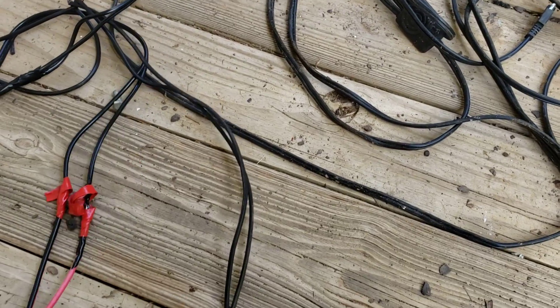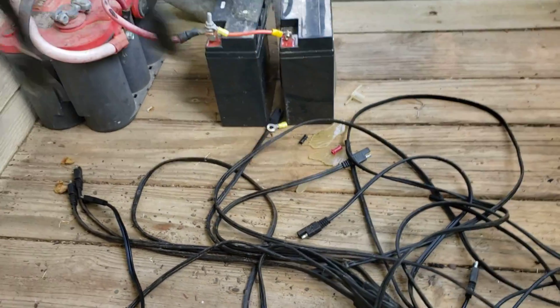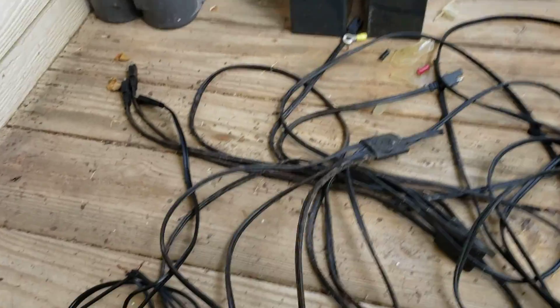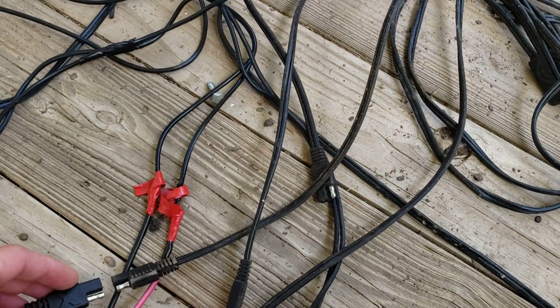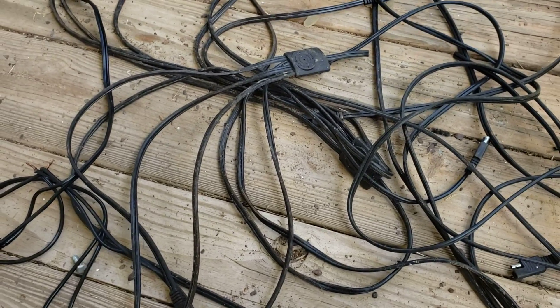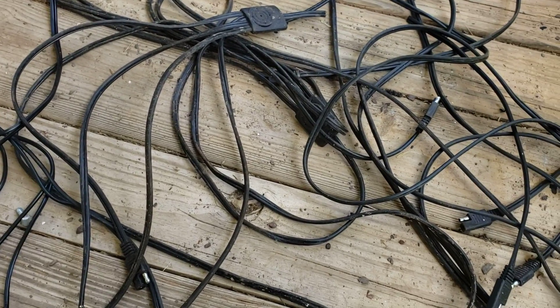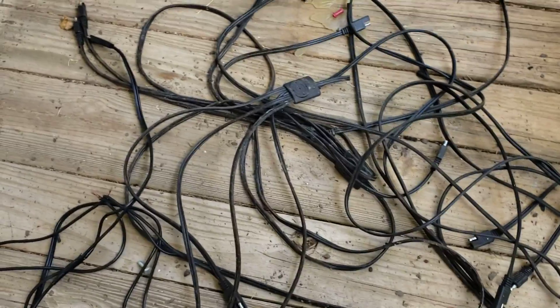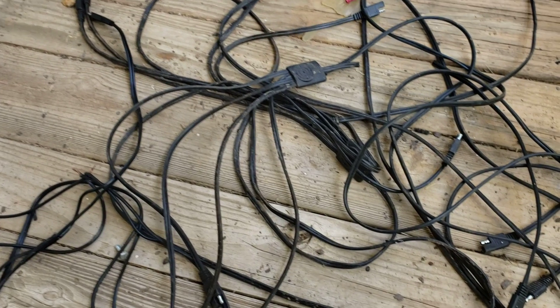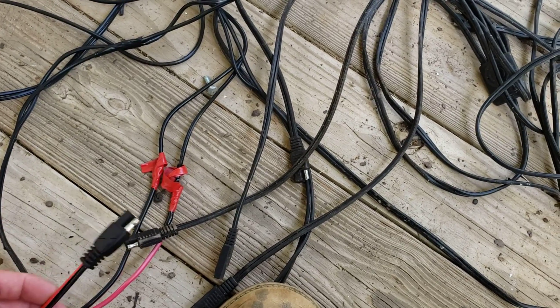The option you have is to get one of the splitter kits from Harbor Freight that look like this — a four-way splitter kit — and you would just plug right into the SAE connections and run it to your charge controller. You have to be careful because of the amperage. We were pulling about 8 amps, peaking around 12 to 13 amps. The Harbor Freight charge controllers aren't designed to handle that — they kept burning out on me, so I got one of those Amazon ones and I'll drop the link in the description.